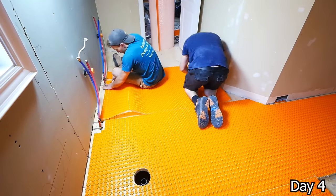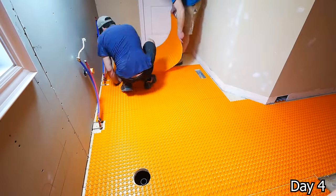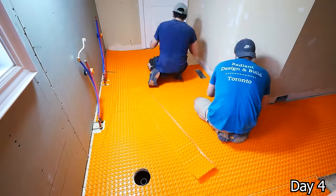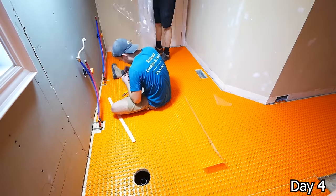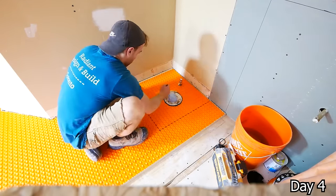So go ahead and vacuum, give it a very damp sponge kind of rub down, let that all dry up as we want it to be dry before we put the peel and stick down, and then just tamp it all down, let it set up. And it really has a nice tight bond despite being just a peel and stick.